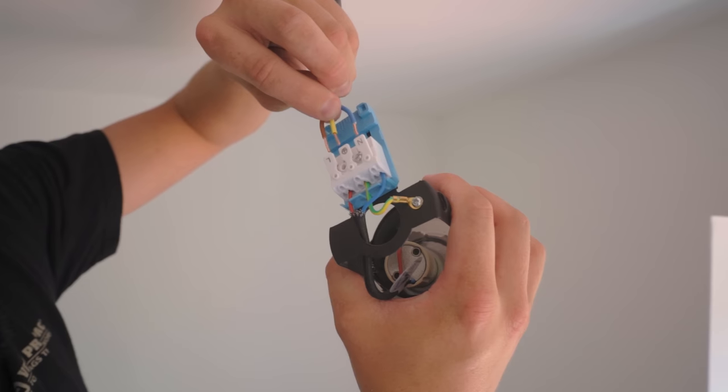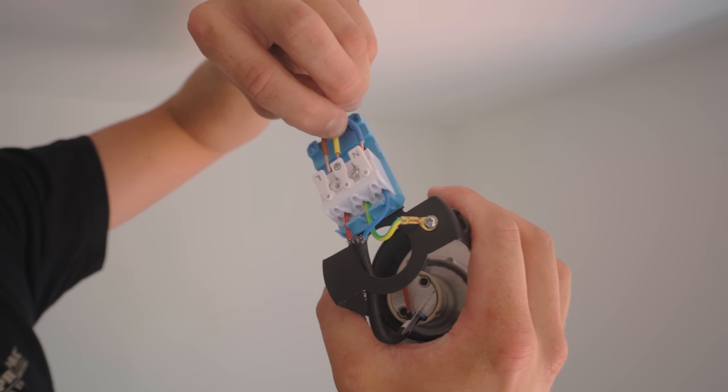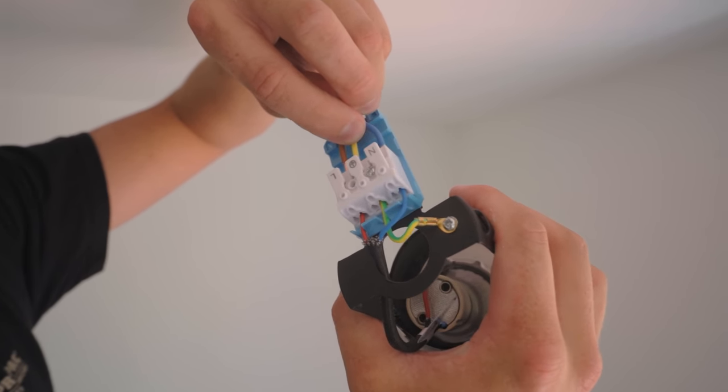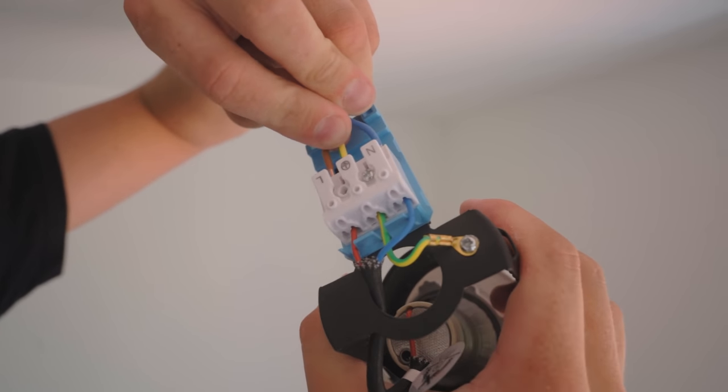It does so much more for your morale. Especially when you've had to second fix hundreds of sockets in dado or something like that — when you get to that end of line, if you save it for the end of the circuit, it's like a reward. It keeps morale high and incentivises you to keep going. Tiny little tip, but great for morale — save the end of line till last.